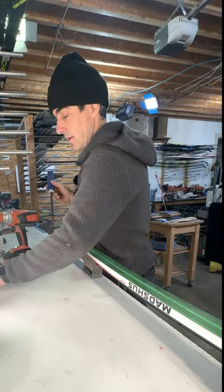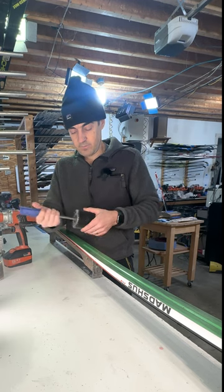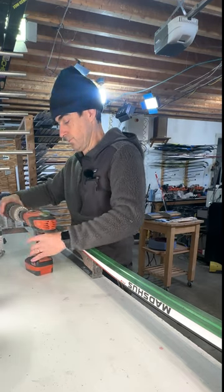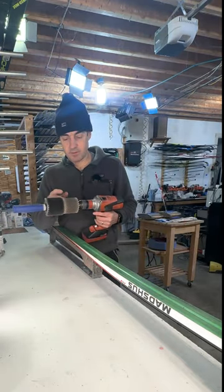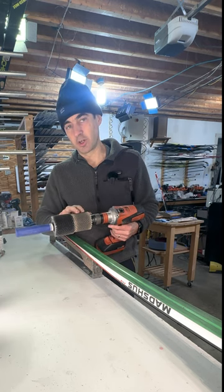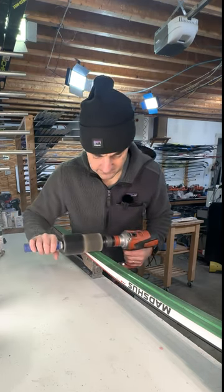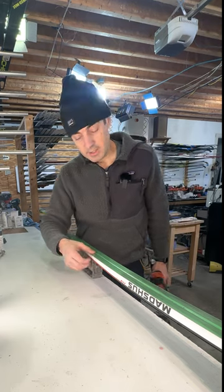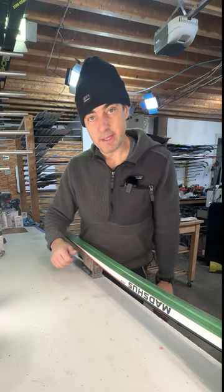So let's look at our steel brush. We've got to check our direction — the steel brush is directional. We'll do the unicorn brush first. The unicorn brush is supposed to be a little more capable of moving material than the nylon brushes, but again it's really targeting surface films and fairly rapid, efficient film reduction. We'll look at it on this MAP Black. While the unicorn brush feels fairly soft, it moves considerably more material. This area is really dark, this is a little less dark, and this is almost starting to clean up a bit.